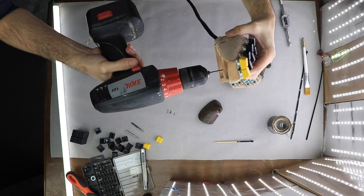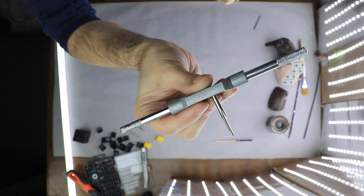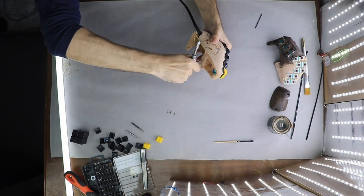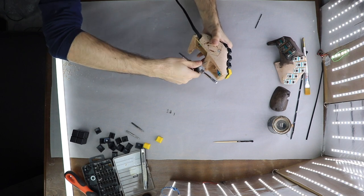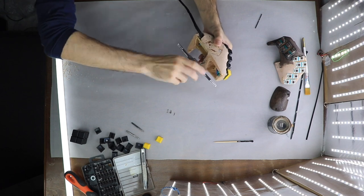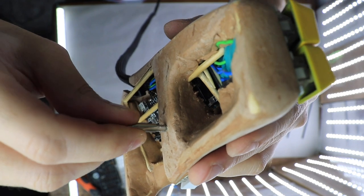For installing the keyboard onto the chair's headrest, I made a clamp-like system that allows the keyboard to slide back and forth across the wooden frame until it's secured. I started by making a threaded hole in the bridge underneath the case. I did this with a tool called a hand tap. You can do this on all sorts of materials, and usually a standard hand tap system is done with 3 hand taps that come in a kit. You drill a smaller hole and then you use the hand taps in a certain order to make the thread. What I learned is that if you are working with plastic or acrylic boards, you are better off using only the first 2 bits, as it will make the thread tighter and will also hold better in time.